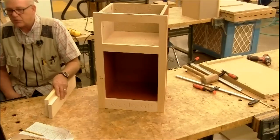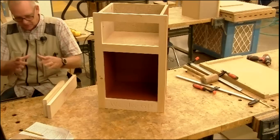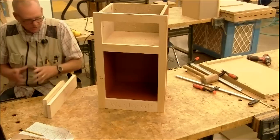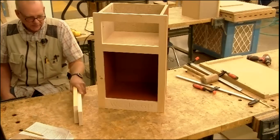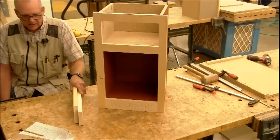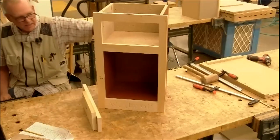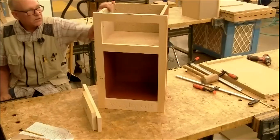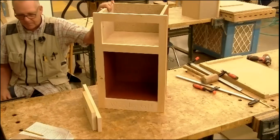are for table legs, things like that. Coffee table legs, dining room table legs, things like that need to be large, and we just can't get the lumber that large. So that's the reasoning behind laminating, okay? And we'll go over that in depth later on in the week, and we'll get the top laminated for the nightstand. We'll get it milled down, we'll get it mounted, and we are well on our way, okay?